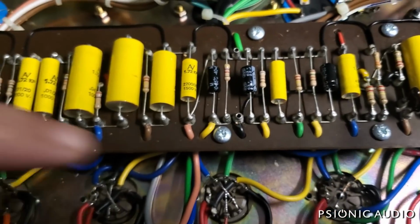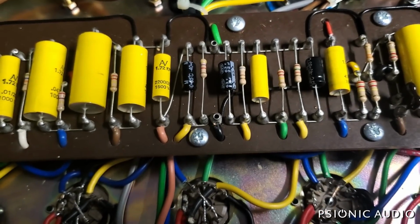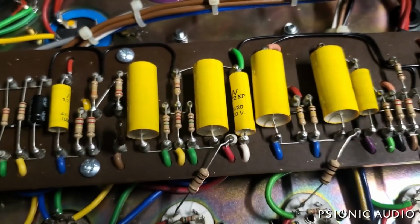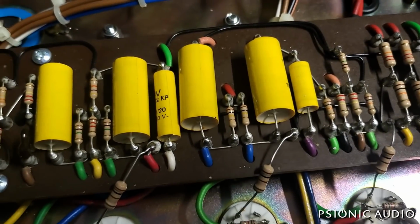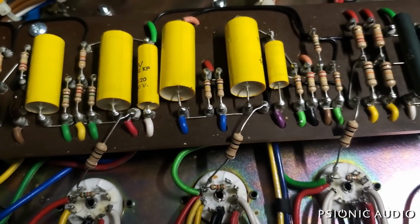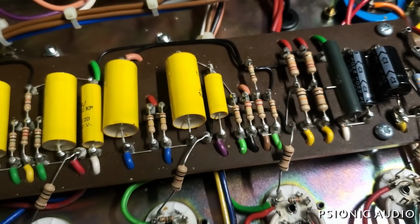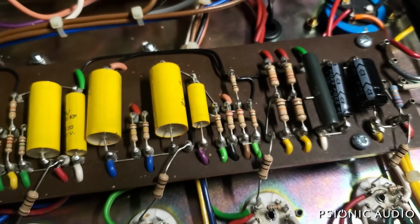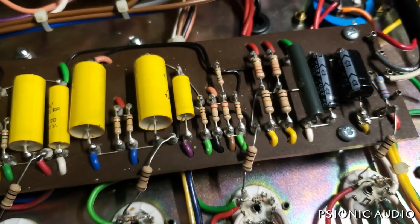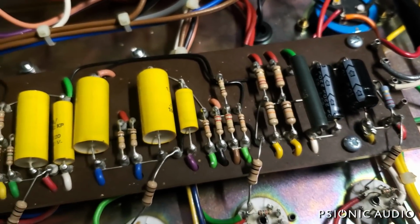And there's like a shared cathode here. I'll figure out what's going on with that. So I've got to at least work out the circuit to some degree to know what's going on. But step one is just to replace the filter caps. But before I can replace the filter caps, I need to have a pretty good overview of the circuit to know whether they're doing a ladder, like a Marshall, or whether it's a tree branch, like a true AC30, and if so, how they're handling it.